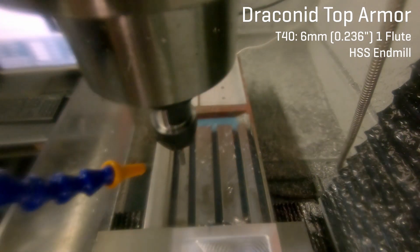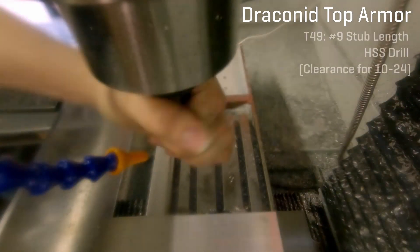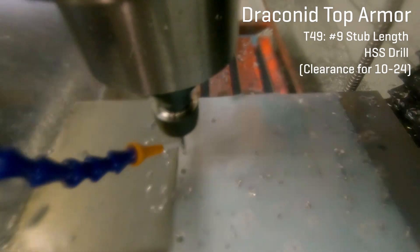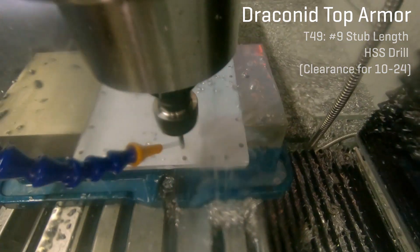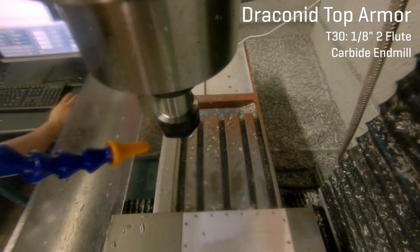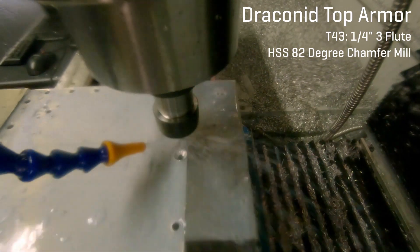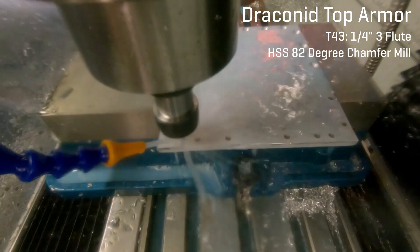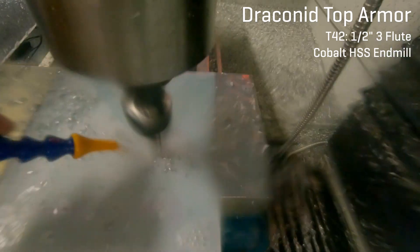This was around the point that I really noticed the difference in height between what the 6mm tool was supposed to be and what it actually was, because there's a pretty visible ridge where the 6mm tool is coming into corners of material that's left where it should have been taken away — since the 6mm tool was slightly shorter than the machine thought it was. Here I decided not to spend time with the eighth-inch tool cleaning up all the holes first. I just used the chamfering tool as intended and hogged out all of the material at a slower feed rate to do the entire countersink at once, which saved a lot of time on this part versus how I did it for the base plates.